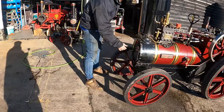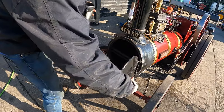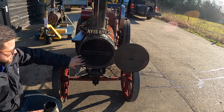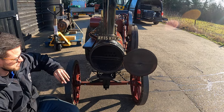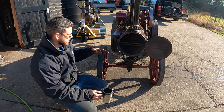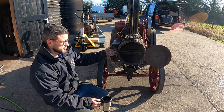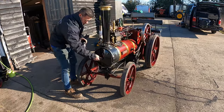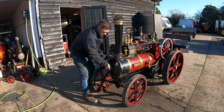The other job we do is sweep the tubes. The tubes are behind the smokebox door, which works on a simple mechanism — the inner one turns the latch and the outer one locks it. Inside there's a series of tubes, and a tube brush of the right size is supplied. You slide it down a couple of times to keep the tubes clear of soot, which keeps the heat transfer very efficient. It's a job you can do at any time — normally just before your next steaming, or beforehand on the day you're using it.